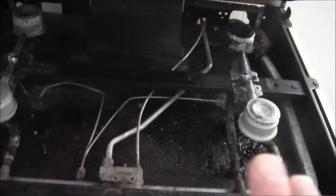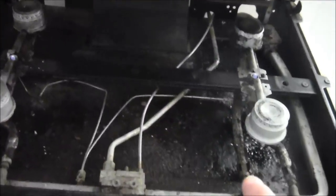If your gas is leaking, or you're going on vacation and want all your gas off, go behind the stove and find the shutoff valve. See that valve back there — turn it left or right and it'll be off. Also check your connections back here: there's a flexible gas line that goes to the shutoff valve. Make sure it's okay, and don't use a wire brush on it because it's rusted and the rust helps seal any holes.